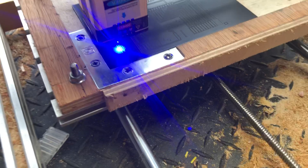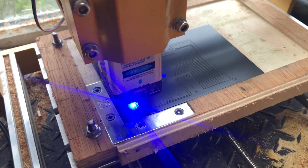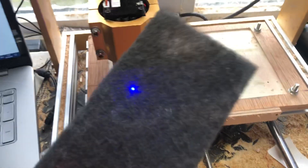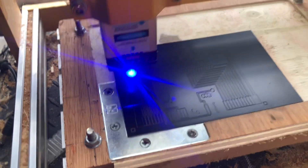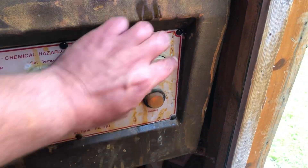Once this is finished, I'll wash it with water and get a cloth and just wipe it over gently. Then I go over it with the pad again — it just cleans it up really. And you can see the copper shining through the paint. Then I get it into my bubble etch tank.